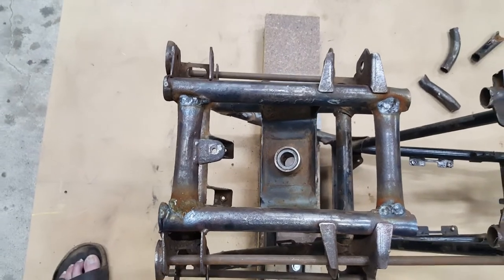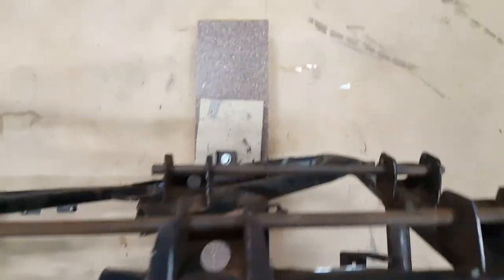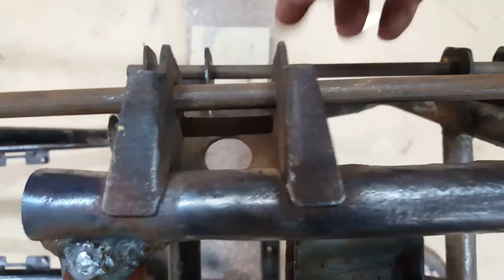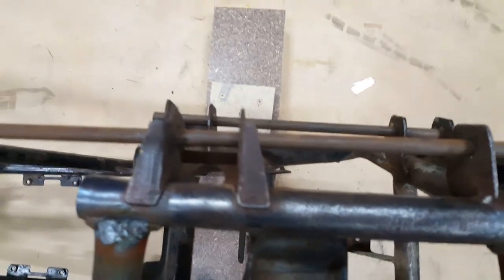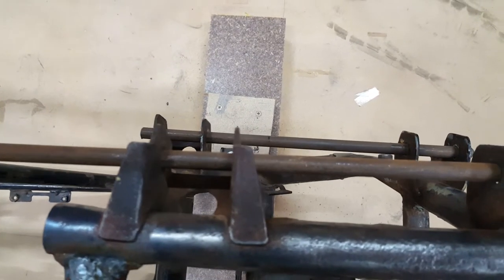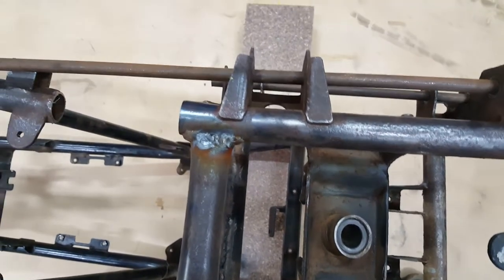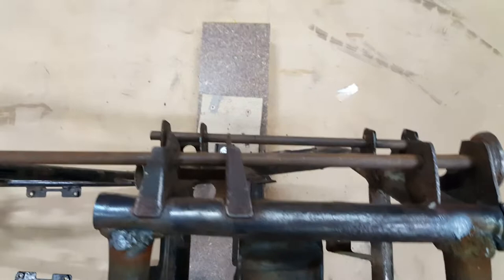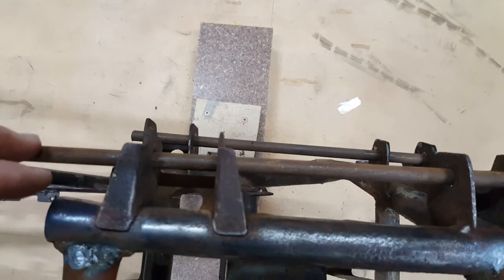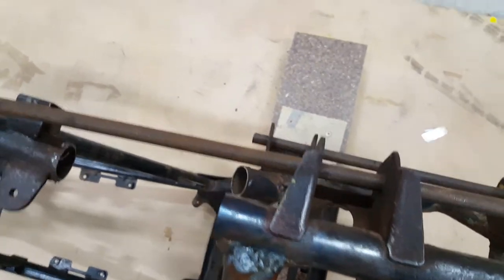There's still a bit of a twist in that top box. I've got bits of rod coming through — the lower one is pretty much parallel to the centre line now that the centre has been moved. This upper one is still out of alignment — over the length of that rod, perhaps three millimetres from one end to the other out of parallel, which I think is pretty close. At this stage I'm going to reconnect the original tube with a new corner piece that I'll bend up, same on this other side.